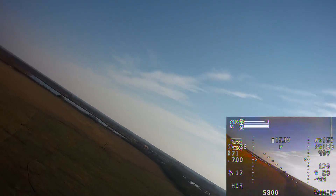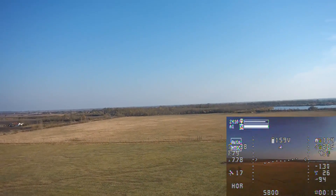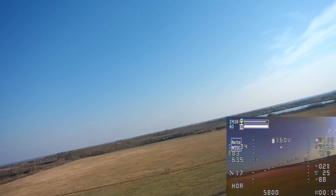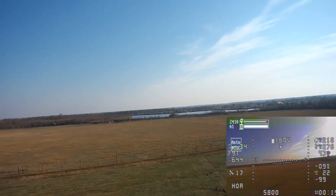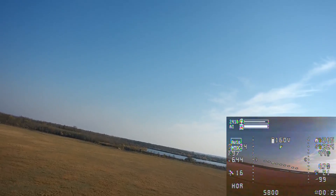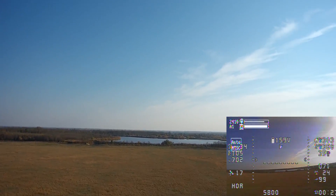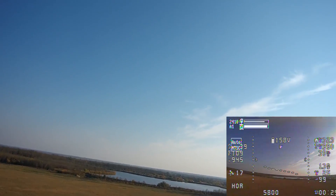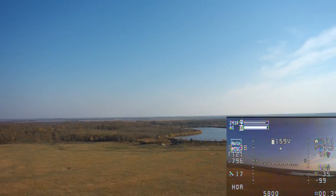Right off the bat, it is flickering. The flickering — and they did state this in the manual — is due to not setting it to auto, where it automatically picks NTSC and PAL. You should do that manually. I think that's what was going on here from the noise that was in the aircraft. Even though I do have a LC filter, there is still some slight noise reaching everything else.